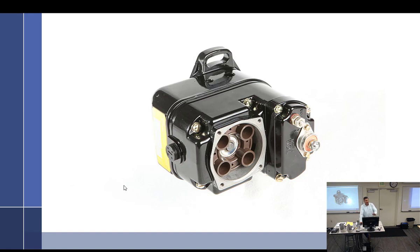Okay, so we've got either two Bendix or two Slicks. I never see a Bendix and a Slick. Or the dual mag. If you're running a Rotax, it's completely different. Rotax has a self-contained electronic ignition system. It's got a giant flywheel in the back with magnetic pickups. It's a magneto basically, but it's just a big one with pickups on it. So you can't take it off. It's part of the housing. Take the housing off and then it's internal.